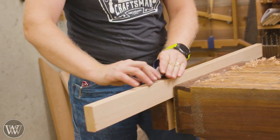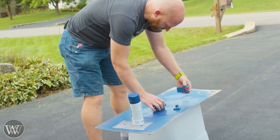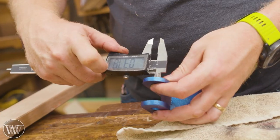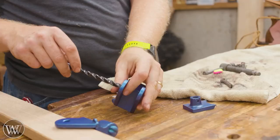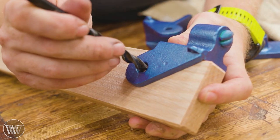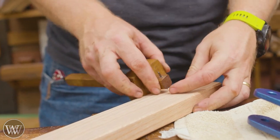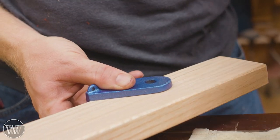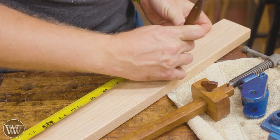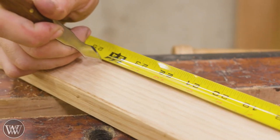Now we can start drilling the holes to attach the hardware. When figuring out the spacing, I actually need to put the screw in and measure the movement of the screw. If the screw moves three inches, I need the holes to be closer together than three inches. I had about three and a half inches of movement, so I put the holes three inches apart, so I can move the screw in and out. I tried to find a bit exactly that size — a good spade bit I had was a little too small, so I started with that and then had to widen it out with a twist bit.